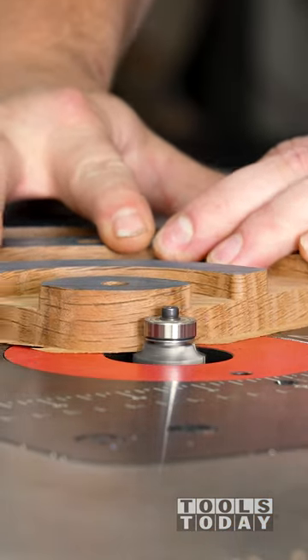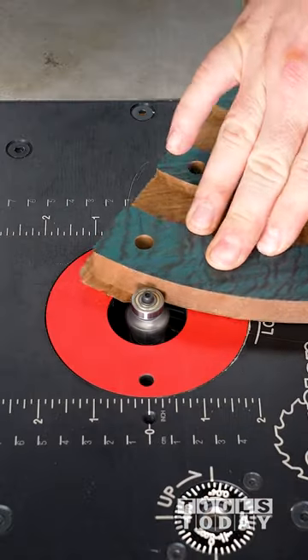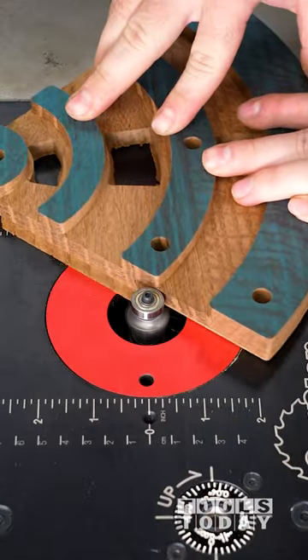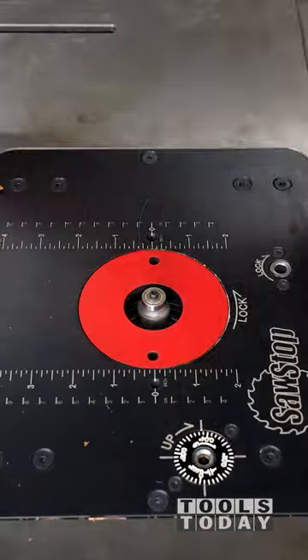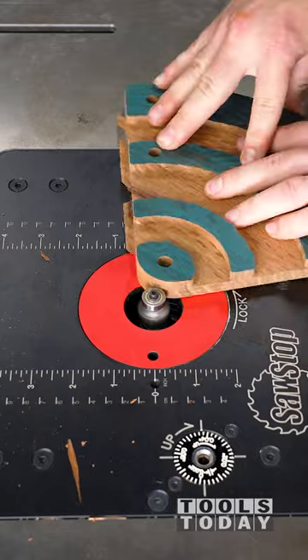I left a little onion skin on these wood calendar pieces when I cut them on the CNC to ensure that they didn't move on me. Using a four-flute eighth-inch radius bit, I'll round over and trim that off at the same time. This bit leaves an incredibly smooth surface and I love seeing the amazing grain of this wood.